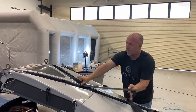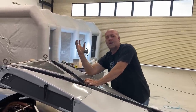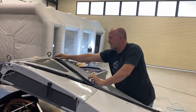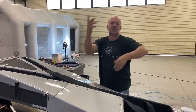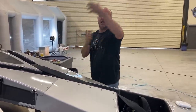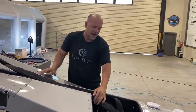So all my connection points, the big half-inch pass-through bolt on a big C-channel subframe I made, I put big rounded radius edges everywhere this cable could pull against so there'd be no sharp edges to cut it, in case the plane was tumbling when I had to pull the chute and the load pulled sideways instead of straight back up top. So I really tried to cover all the bases.